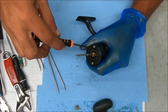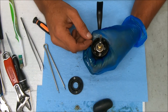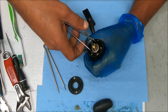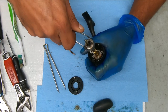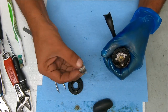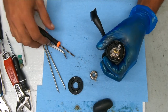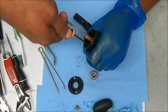I'll pull that straight up — we found some rust. That's not good. I mean, that was the one part where we would expect there might be an issue. So now we can remove that bearing by undoing these two screws to remove the bearing cover. We're going to keep these screws separate because they're different sizes.